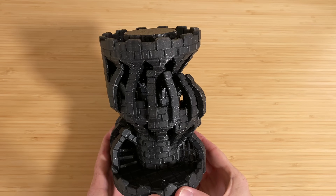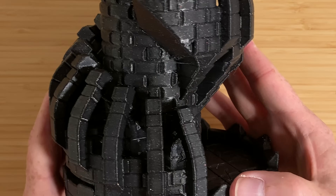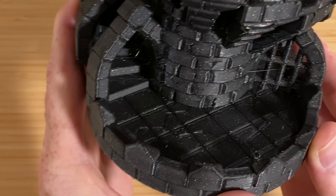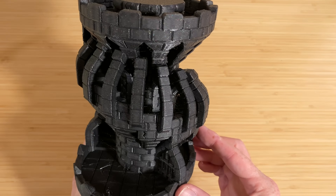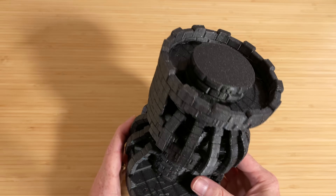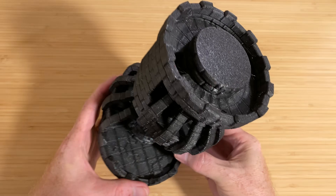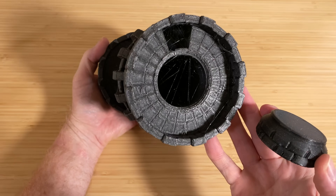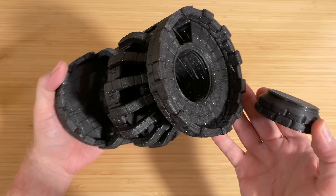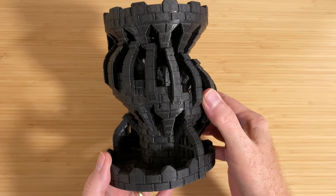This is ClockSpring's Battlement Dice Tower, printed in ProtoPasta Wonder Black HTPLA, which has nice multicolor glitter bits in it. It did come out a bit stringy, so I might have gotten better results by drying the filament first — it's a spool I've had for a while. It printed in just over 9 hours. In addition to the stringing, it printed with a matte finish instead of gloss, and I think that's due to the printing speed — reducing the outer wall speed to maybe 60mm per second might have given a glossy finish. Removing the lid reveals a storage compartment for dice, and when you drop dice down the stairs, they roll and tumble out onto the base. Apart from the matte finish and stringing, the structure came out fine, and I can clear the stringy spiderwebs with a heat gun.